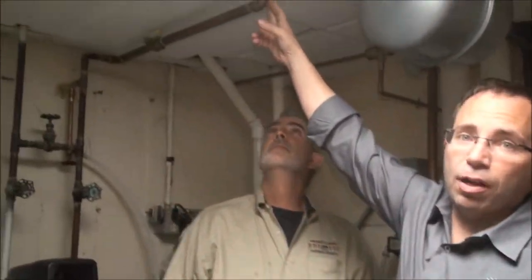Our goal here today is to explain to the customer watching this video that this is a home that's been remodeled once or twice and it has its own private well. We're going to take a look at how the water comes in from outside through the concrete wall and into this home. What's above Mr. Kraft is one-inch plumbing that is servicing the entire home — providing both cold water feed for the water heater and the cold water side of the entire house.